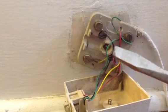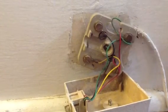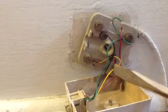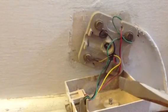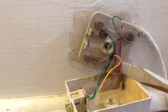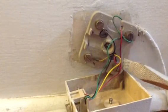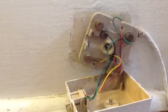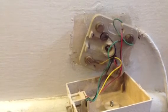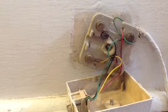I also recommend that sometimes phone lines just go bad and you need to just replace a line. Make sure all your connections are tight. But keep in mind, there is voltage going through these lines, and when your phone rings, you'll get about 90 volts. So you might want to disconnect your phone lines before you tighten up all your connections. You can find your static there. You could always call your phone company and they'll come out, but it'll cost you an arm and a leg to find it.